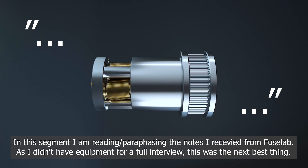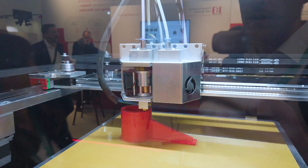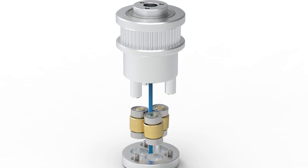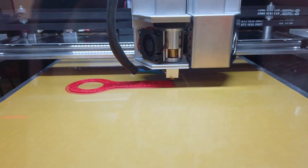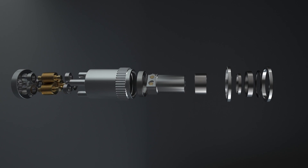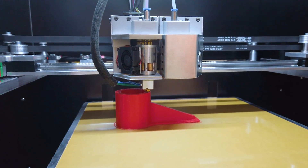The way to think about how this extruder works is by thinking about a ball screw. With a ball screw you've got a threaded rod with half-moon shaped threads, and a part that moves up and down with recirculating balls for a very low friction motion system that turns rotational movement into linear movement. The key difference here is that instead of the screw rotating to make the nut move, the nut rotates to make the screw move. In this extruder the nut is the teeth and the screw is the filament — the teeth are part of the brass rollers which, as they rotate around the filament, form a helical groove giving a screw-like thread that results in a net downward force pushing the filament.